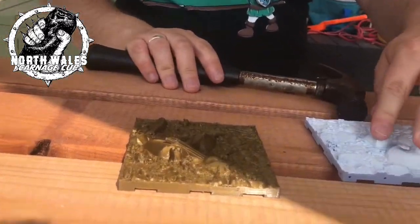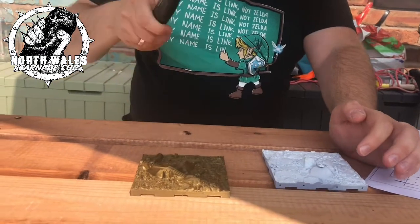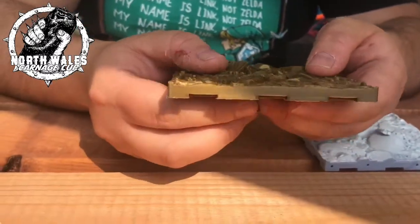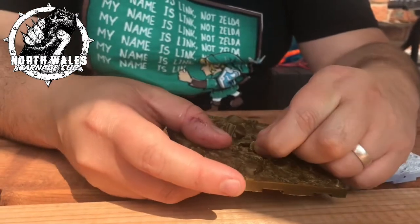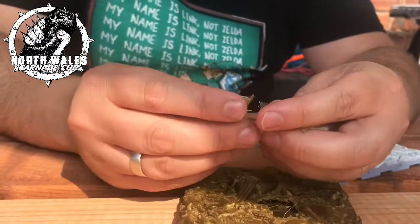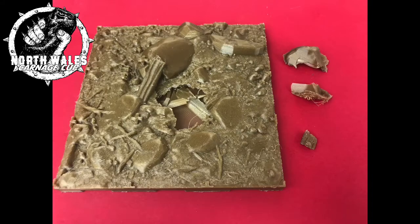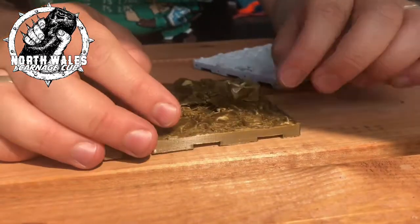What finished off the SLA was being hit with a hammer, so I tested this FDM one with genuine decent hard hits. After a few hits, nothing happened. But eventually it has definitely smashed into it and shattered all the way through. This is the inside - it was done with a 20% infill, and you could up the infill amounts. But I don't think you need to. That was excessive force. It's probably repairable if you absolutely had to, but you shouldn't be hitting it with a hammer, so that shouldn't be a problem.